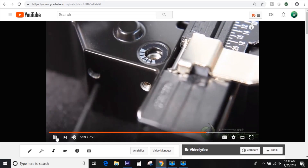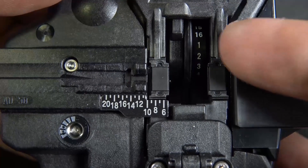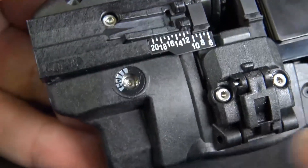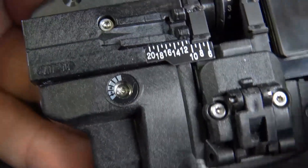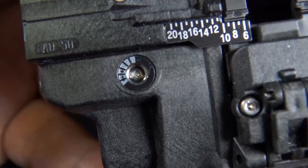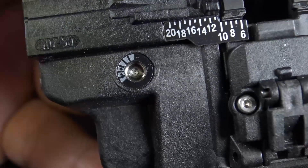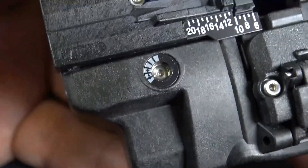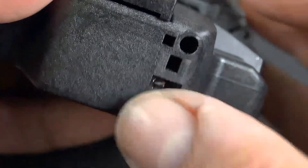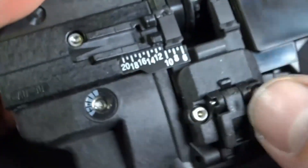With the new one it's much easier. Once you go around all 16 positions, you'll see a very small dot internally on that wheel. You want to move it to the next line using the wrench — stick it in the side and move it just enough so you can see it. Rotate that little dot to the next line and that moves the blade up one position, then go ahead and go around the wheel one more time.